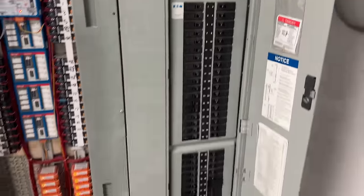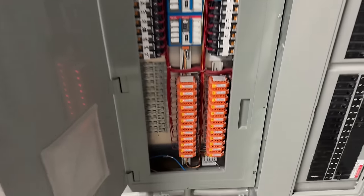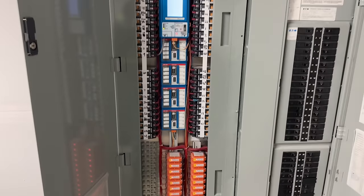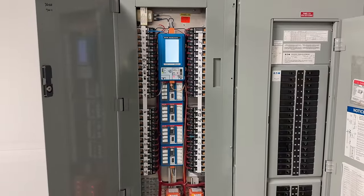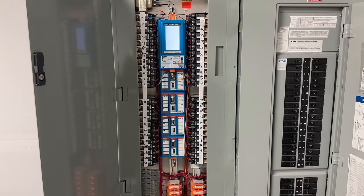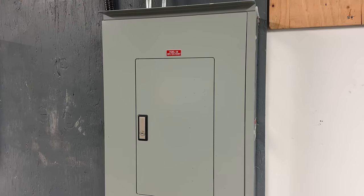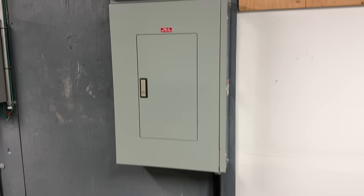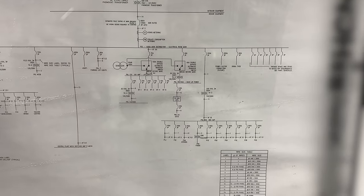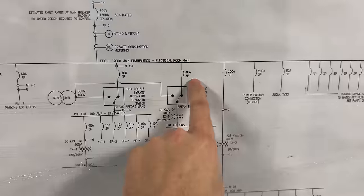These are all emergency circuits, and some of the lighting control is emergency lighting. These modules here basically mean that if the power goes out, the lighting control for certain lights controlled off of the lighting control system on emergency power will ignore any command from the lighting control system or switches, and will override and turn on. This is the other emergency panel here — 120/208 — which then goes into the UPS. These are our schematics for the service. You can see there's our 70 amp, there's our 40 amp, off of the main distribution.